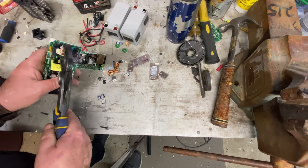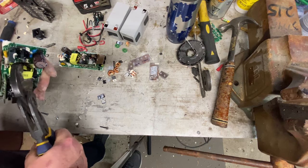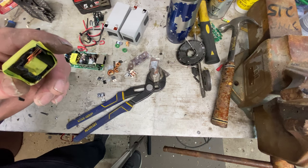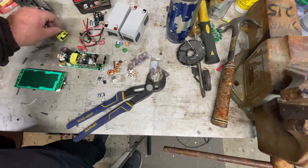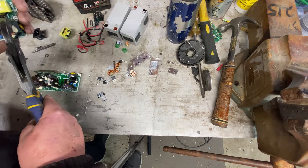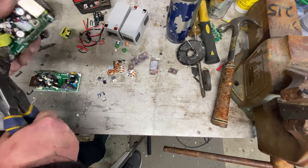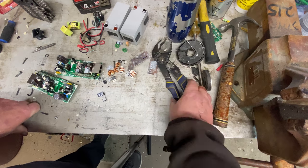The last thing to do on this board is pull off these little motors. These transformers I don't strip down because there's a winding of tape on angel hair and it just keeps going layer by layer — they're impossible to get clean in an efficient way. Just grab onto that one, give a little twist and it comes off. Do the same with the transformer — comes clean off. And that's it for the power supply board.